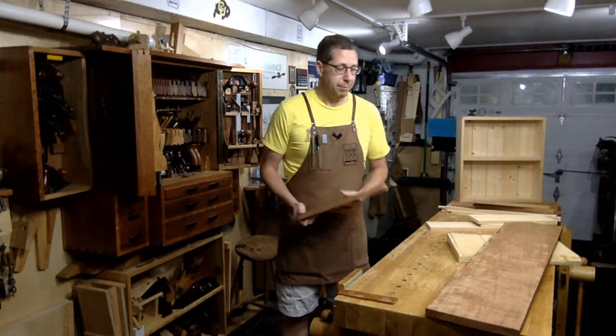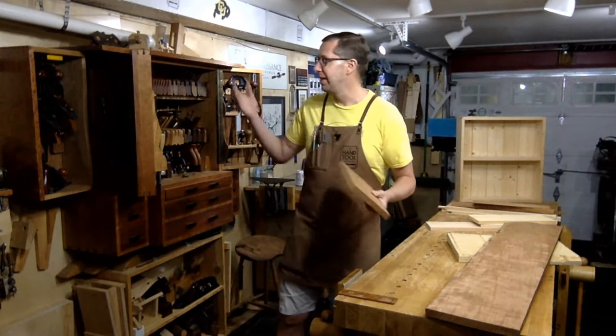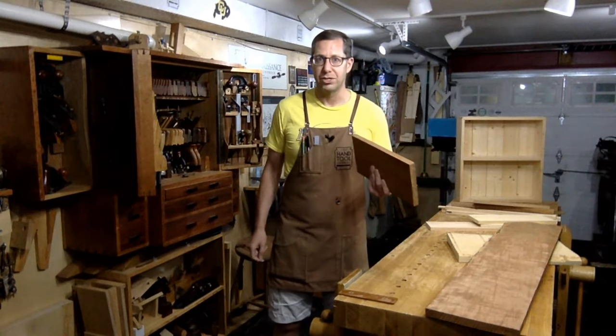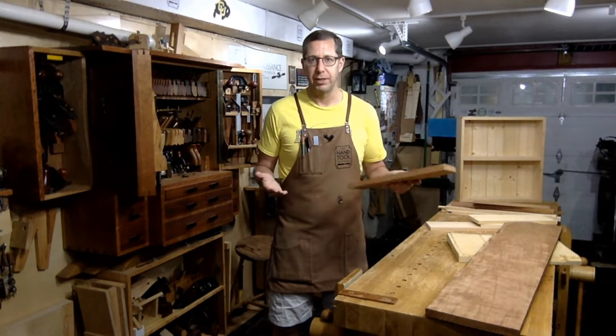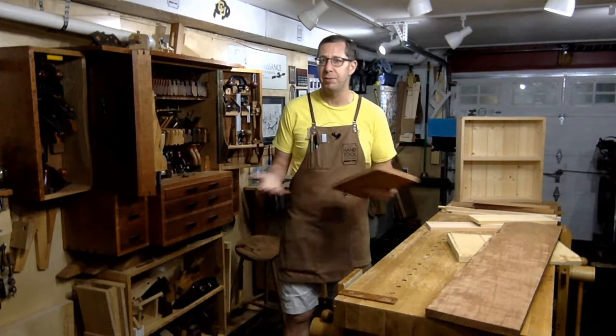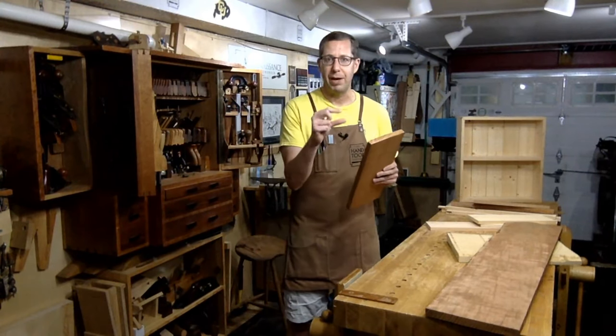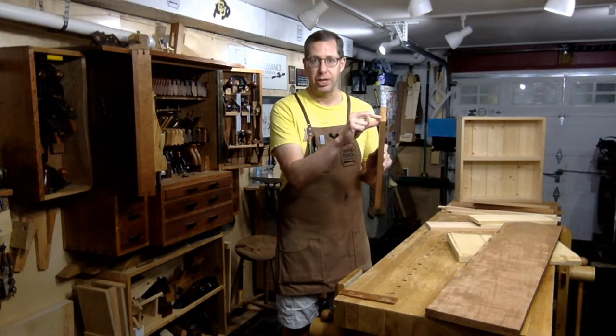It slows me down. But I also don't find that most dovetails, like if you're doing a carcass side that's 7/8 of an inch or 3/4 of an inch thick, that's about the deepest dovetail saw cut you're going to make. Obviously there are some weird exceptions, like dovetails on my workbench or something, but for the most part, the saw cut is only about 3/4 of an inch deep. A lot of times it's much shallower than that.